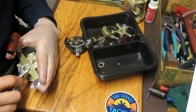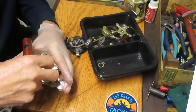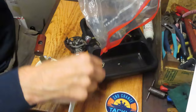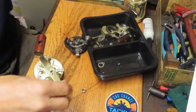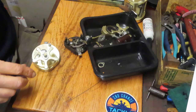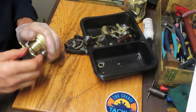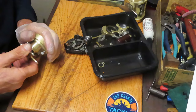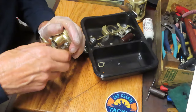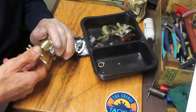This one has been stripped. Remember what I always say about putting these things on square - this one's not on square. That could be a reason why the thing isn't working the way it should. I know the handle isn't the cause of the issue. There are some missing springs and some other things going on on the reel that he says is the original. So we're going to take the star adjuster off, and now we're getting up to the point where it was stripped. The post - he has given me a replacement post, so we'll see what we can do there.